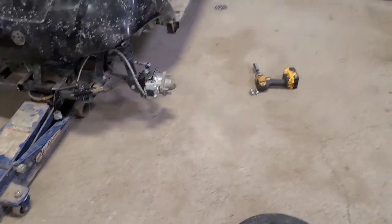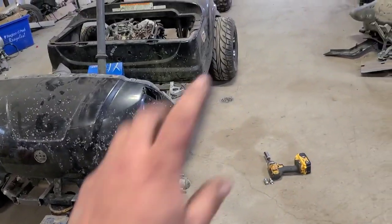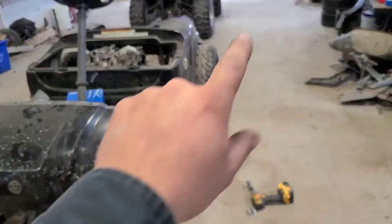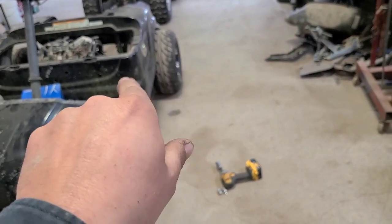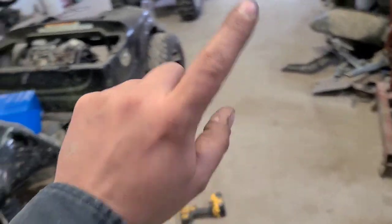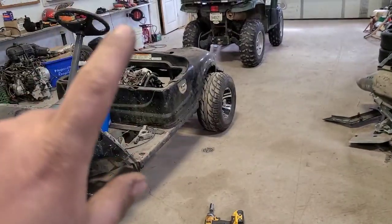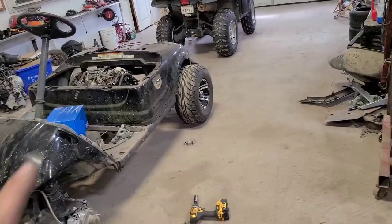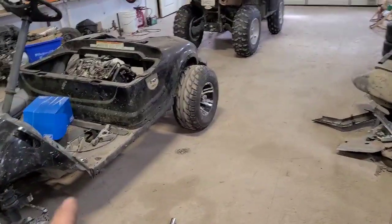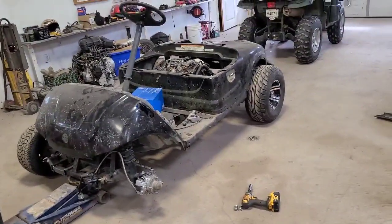So I'm confident enough I can copy all that with the other parts I got and get the other side rigged up. Then I'll get the rear axle and take those hubs off. I picked up a broach kit, so I can cut my own keyways in those hubs that I made. Then I can key them to that shaft, get the sprocket on there and the brake rotor, and rig up a caliper on the back of that. I picked up a long brake line too, so maybe we'll get the pedal assembly in there and get some stopping action happening on this thing.